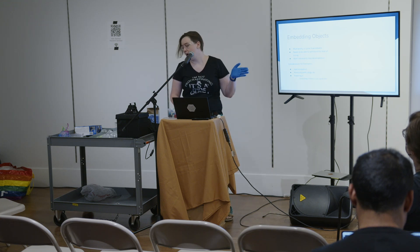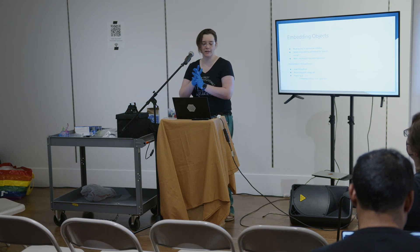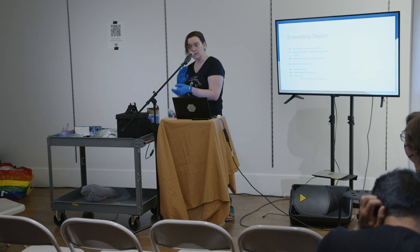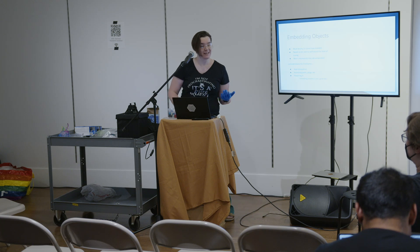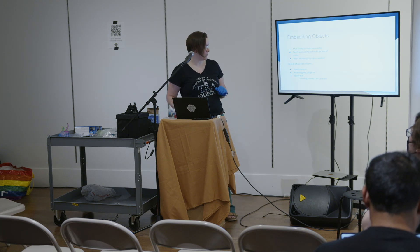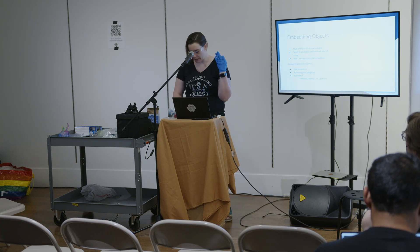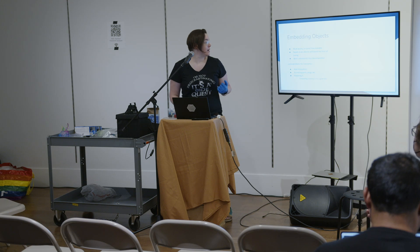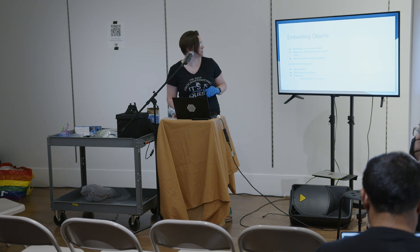Accessing power ports and plugs — I had to tape this off. If you're dealing with a microcontroller that you're trying to embed and it's going to need USB access, make sure you block off the USB port so it can still be accessed. Same thing with network ports. If you need any kind of test points, yes you could try to drill through it afterwards — you can drill through resin, you can sand it — but I recommend just trying to get it set up to begin with. Please don't embed batteries. That's a great way to create a bomb if it starts to decompose and degrade. Your electronic is also less serviceable because batteries are often one of the first things to die. You can embed a wireless charger, that's totally fine. You can embed a cable or some wires. Don't embed a LiPo.